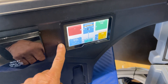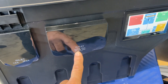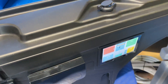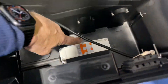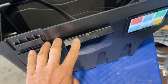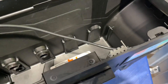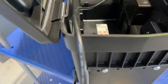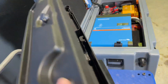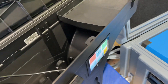On the passenger side we've got a screen here with a 15 amp inlet, a double-pole 10 amp IP65 outlet, and we're adding a 15 amp outlet down here for the towed caravan. If we open this up, inside we've got the RCBOs down the bottom — we're adding one more in here. This screen is the HDMI, so the only things in here are the 240V wiring and the sealed HDMI cable — it's fixed and doesn't unplug, so there's no impact on the 240 volt cabling. All the glanding is at the back, very nicely done. This swing case also comes down and can be locked.